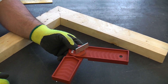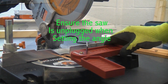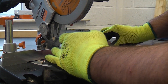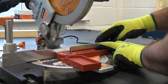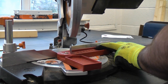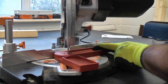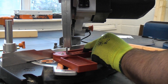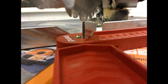To demonstrate that I'm now going to set up the saw and cut two pieces at that angle. If we put the Angle Fix onto the base of the machine we need to turn the blade so that it's directly in line with this flag. I'm just going to hold that with one hand and turn the blade with the other. Pulling it down, we can see we just need to go a little bit more. And now that is perfectly in line with the flag, so I'm going to lock the mitre saw in that position.